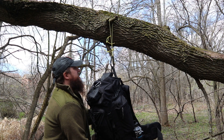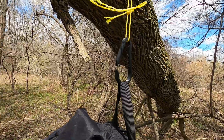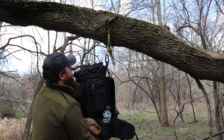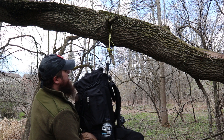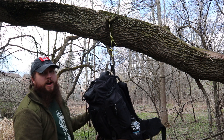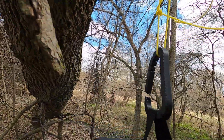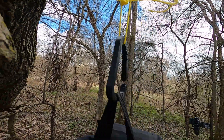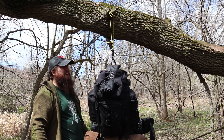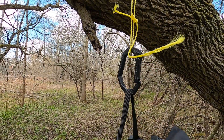The third design held up reasonably well, even though it had the clasp open just a tiny bit from the weight of the bag, making it not that secure — things could slip out, especially since it has no closing mechanism. The fourth carabiner I was erring on the side of it being a failure, but surprisingly it actually held up the bag with no severe trauma to the plastic, despite the spring section being a structural weak point. However, the force of holding the bag did stress it enough to pop it open, being a risk of losing anything on it. The final design was the saving grace of the bunch — it held up the bag without any complaint. In fact, I think it might have been able to handle almost twice as much weight before I'd even be concerned about it failing.